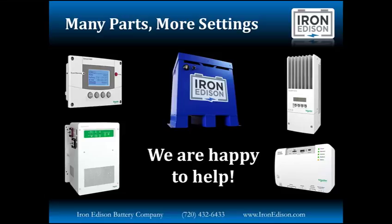The answer is yes, we can use a generator in an AC coupled system. In this configuration, the solar inverter is landing on the AC1 terminal and passing energy back out to the grid through the grid input terminal. The AC2 terminal, which is reserved solely for the generator, when the generator comes on, the inverter will sense this. And the challenge with typically running a generator and an AC coupled array is that the generator could be backfed by the solar array, which could cause significant damage to the components of the generator. So we have to separate those two inputs.